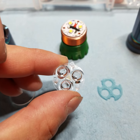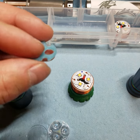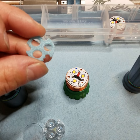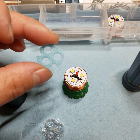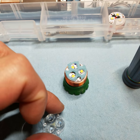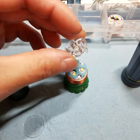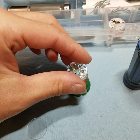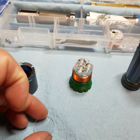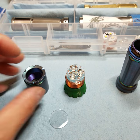On the bottom side, he actually casts it in there. Chris had asked for both the glow gasket as well as the glow optic. The gasket sits on, and then the optic goes on top of it like that. Then the glass — the sapphire lens that we use — goes on that, and then it all assembles with the head.